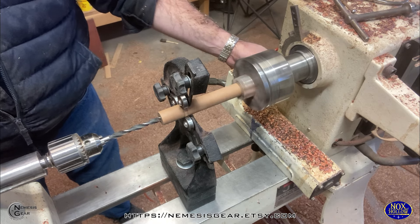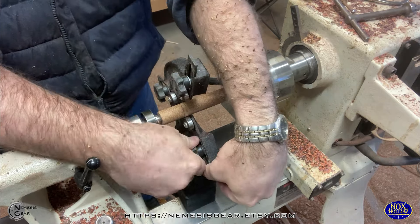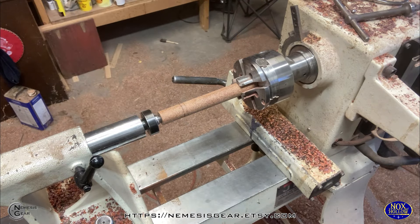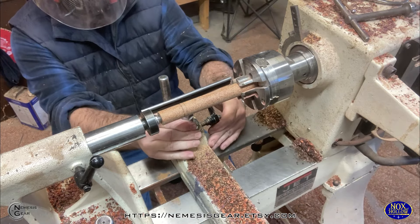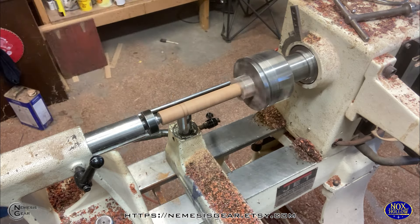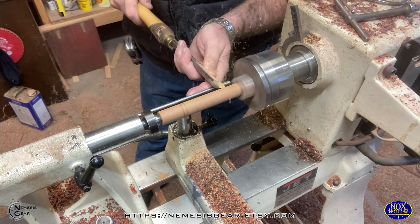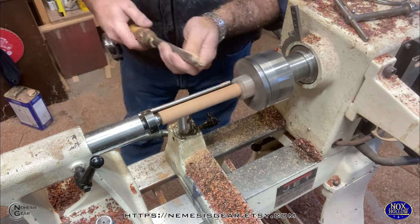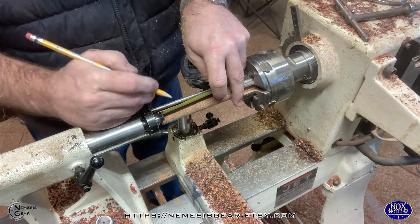But it is a really pretty wood. I just put this in the round and I'm going to glue this up with a chuck. I drilled out a hole in there, so I've got this in the chuck and it's drilled out. Now I'm going to go ahead and shape the handle. I've got to get this nice and even here, because just in case that hole is just a little off center — even with that steady rest I'm using — it's really hard to get those perfect every time.